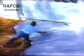Control joints should be designed into the slab as you would with any conventional slab. Here, a groover is used to form the control joint. Expansion material or saw cuts may also be used.